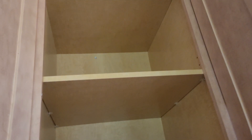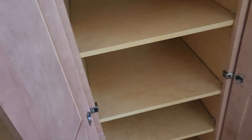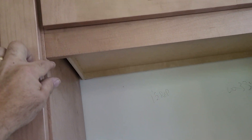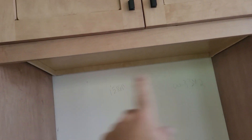There's a roll-out underneath — no problem, lots of storage below the oven. Here's the pantry cabinet — single shelf on top. On the bottom section you've got four shelves and a floor. One of those shelves could definitely be moved to the top to create wider spacing. We added a two-inch piece making this right at 70 and a half inches tall. Most refrigerators we're running into are 70 inches tall, so this should clear with about a half-inch to spare. Always leave 37 inches on your refrigerator spacing.